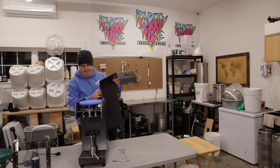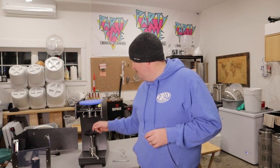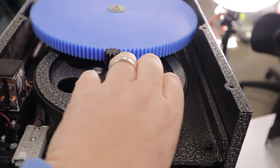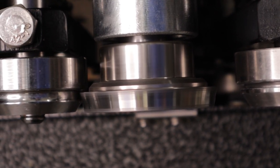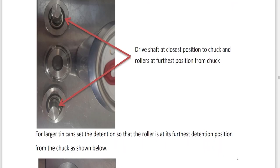So the first thing you want to do when you get this is take the cover off to examine the insides. Here you'll be looking at the chuck, the rollers, and the flywheel or the gears. Keep it unplugged and manually turn the flywheel to ensure the gears mesh nicely, and more importantly that both rollers don't contact the chuck. If they do, you'll have to make adjustments to the positioning of the rollers — this is clearly described in the user manual, which you'll have to get online. I'll link a video in the description that shows you how to adjust the rollers and check the tolerances.